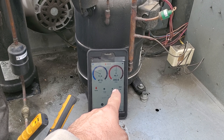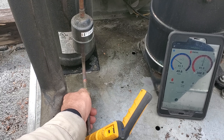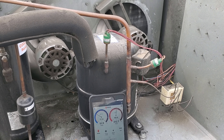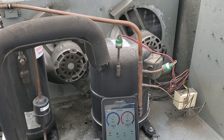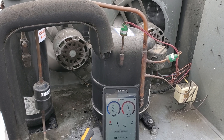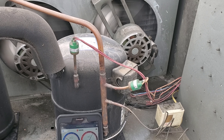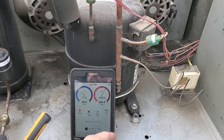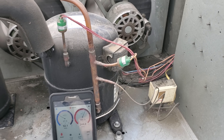It's weird — I'm at 205 now. That is liquid line pressure, so I have to be careful because the fan cycle is on the discharge line. But it's weird how quickly it was turning on and off. I'm not liking how that fan cycle switch is working — we might have to change that. I'm going to bypass the fan cycle switch.